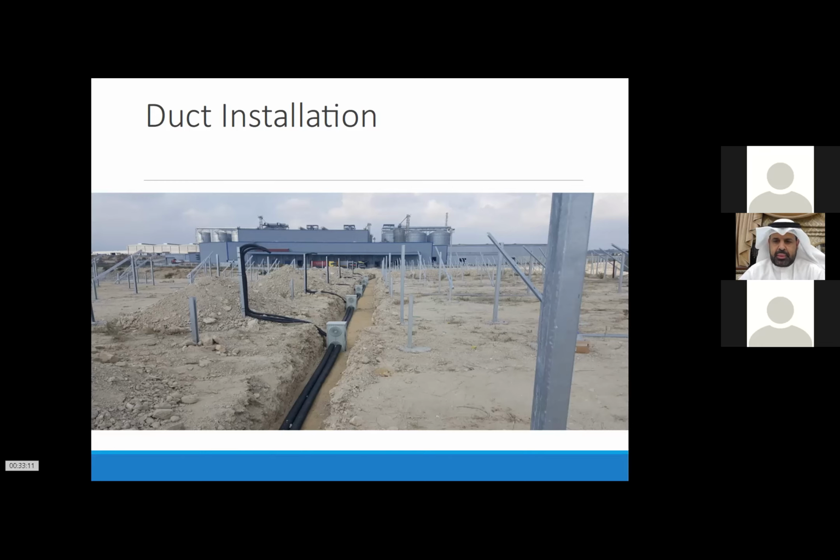That's not so good. I had inverters in Africa where I had to ground the outside plug. So it's floating, like 120 volt neutral and 120 volt phase, right? And then you used one of the phases, earthed it to the ground, and then you had 240 volt. But it depends on how the filters are connected inside. Some systems also earth the negative pole of the batteries. So maybe you ask the question in the tutorial and tell me more about the inverter. Then maybe I know more.